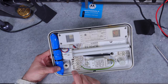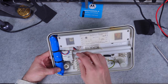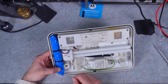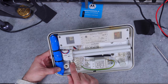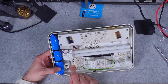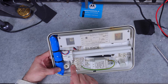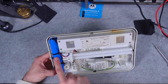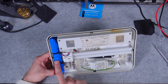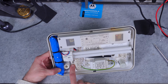We've got A and B joined together so the lamp should be on, but it's not — maybe the battery is not charged enough. Then we've got our neutral to connect to AC. The live terminal is going to be provided constantly to the light fixture to recharge the battery and to sense when there is a power outage — this live should be constantly on.